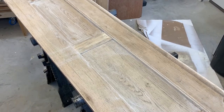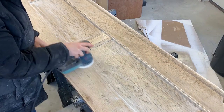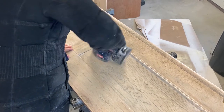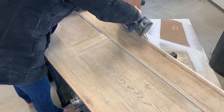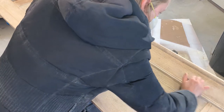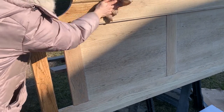After the A-B bleach is dried, it will leave a white, salty residue on the piece. I sanded this down using a Bosch Orbital Sander for flat, open surfaces and gentle curves, my Ryobi Corner Cat Sander for corners and edges, a sanding sponge for tricky parts, and a sanding attachment on my Dremel for finials. To neutralize this, I used a vinegar and water mixture per the instructions on the bleach, wiped it off, and let it dry completely overnight.